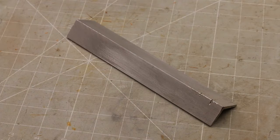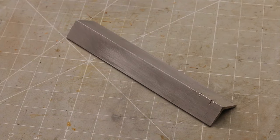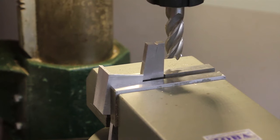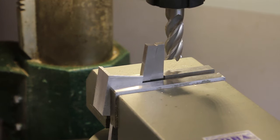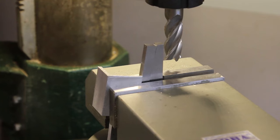The second item is the dovetail gauge, or rather a pair of them. The dovetail marking gauge is one of the easiest things to make. I shall be making it out of this piece of scrap aluminium angle. Cut approximately to length, I then used angle blocks that added up to 8 degrees to set it at that angle. Clamp tight, I can now mill it.